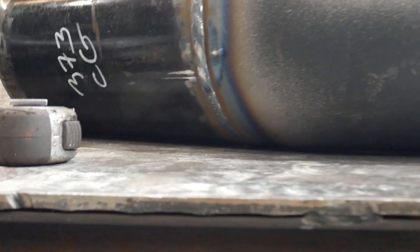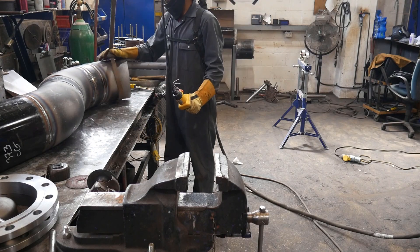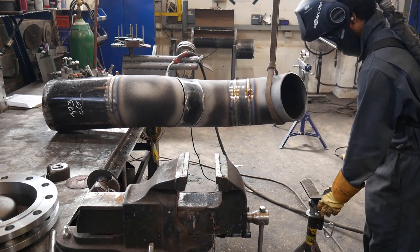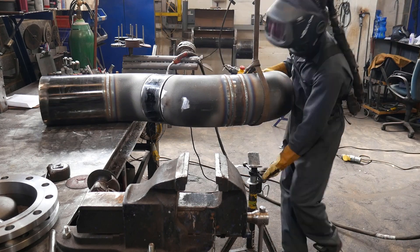That's why I use my table — you can see underneath it the whole pipe's running straight and true. I've only tacked it in one orientation, so now I want to flip it around just to make sure I got the set correct and to make sure the piece of pipe in the middle is at 45 degrees.